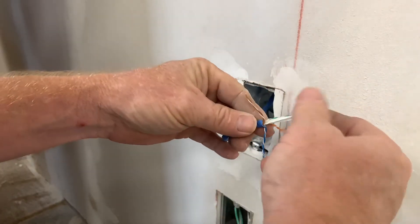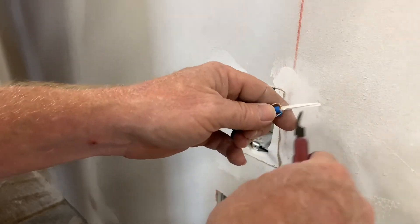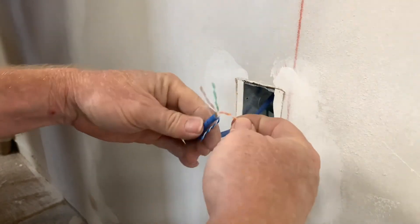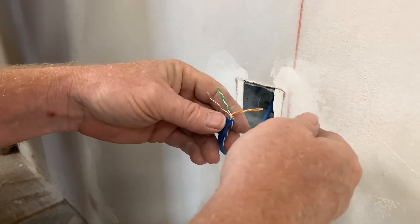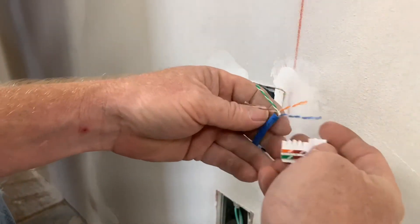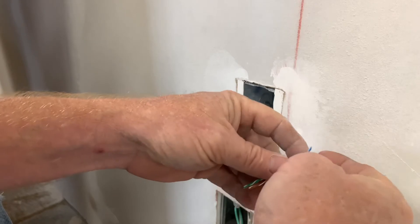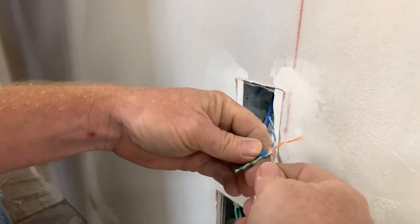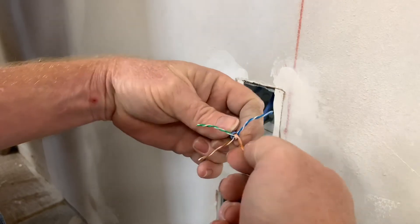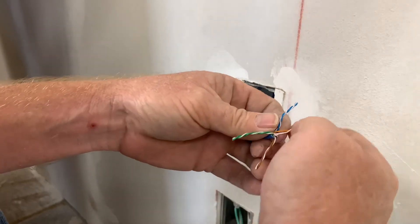I just cut that string off and peel these wires back so you can get to that guy right there. Some of your cat six has this in it, some don't. We have the orange and blue on one side and brown and green on the other. So there's brown and green, and then orange and blue — we'll swap those around. We don't have to untwist them all the way; we just want to untwist them far enough to separate the two colors.